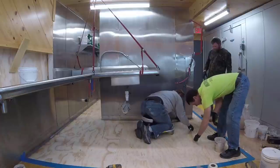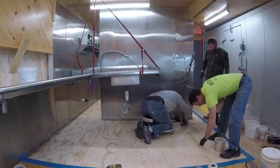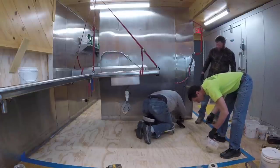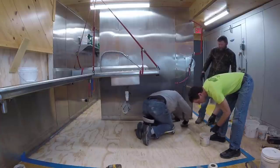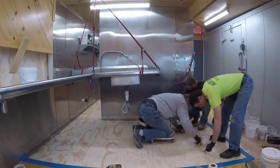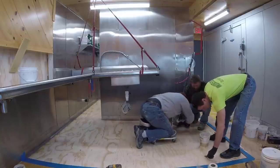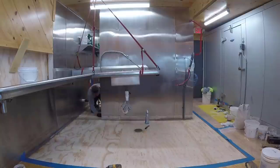It's a precaution, but if you're going over wood you definitely want to do this first. If you're going over concrete and you've got cracks in the floor that you think might still be a little active, you can do the same thing over those cracks. Otherwise, just repair the concrete crack like you would any other crack. I'll have a link for that at the end of this video if you want to learn how to repair concrete cracks. I'm basically using a putty knife to spread the epoxy out and Luke's just pressing the mesh tape over the wet epoxy.